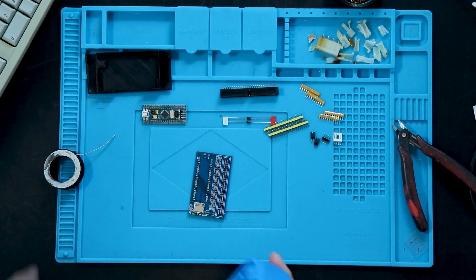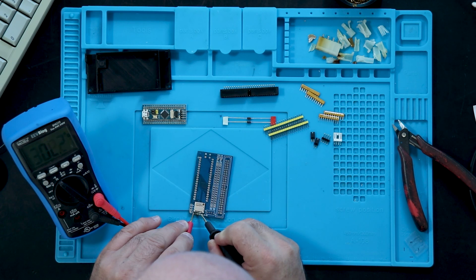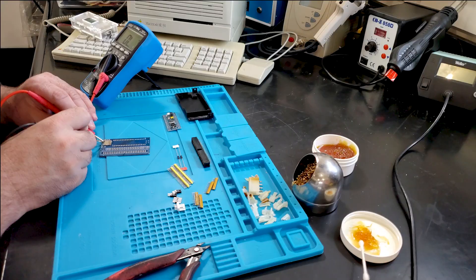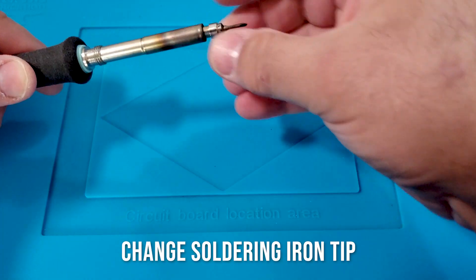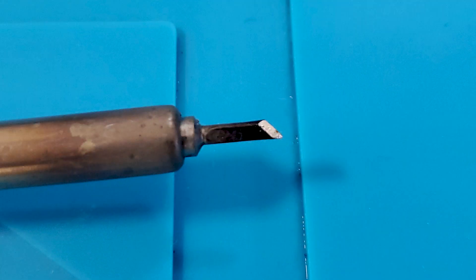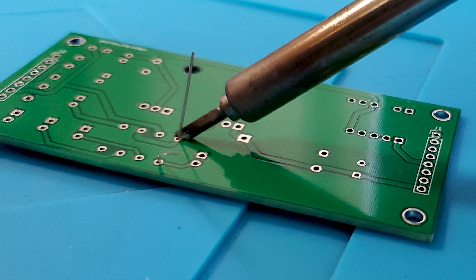That was a fiddly bit of a pain, but not nearly as bad as I feared. I'm a huge fan of checking your work as you go, so even though it looks perfect, I'm going to check all the contacts with a meter — making sure there are no pins shorted to adjacent pins and that each pin, except the outside two which have no connection, is connected to a trace on the board. Now that everything checks out, it's time for the much easier through-hole soldering. Change the tip on your iron to a chisel tip. The idea is to apply heat evenly to both the pin and the pad at the same time for a good solid connection. If you only heat one part well enough to melt the solder, you'll get a bad connection called a cold solder joint. It may work fine at first, but over time they tend to loosen up and cause intermittent problems.